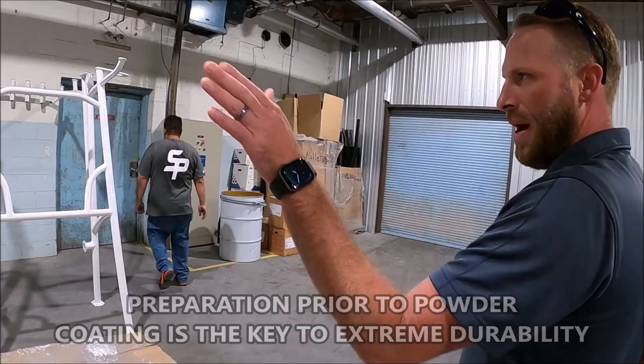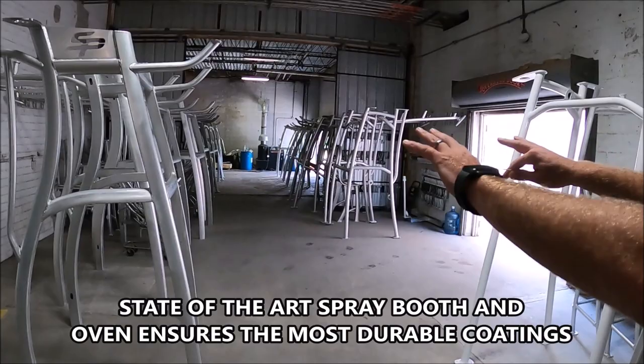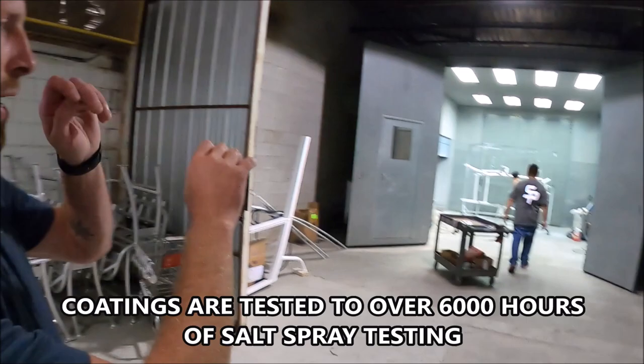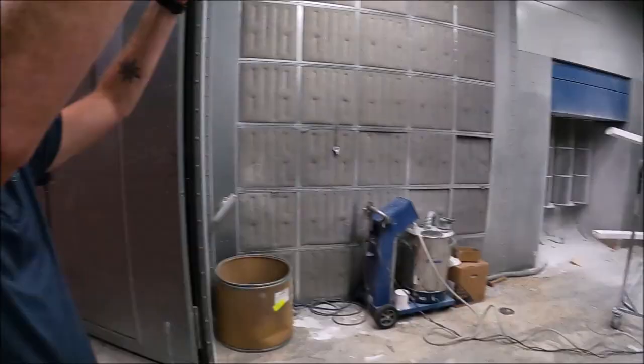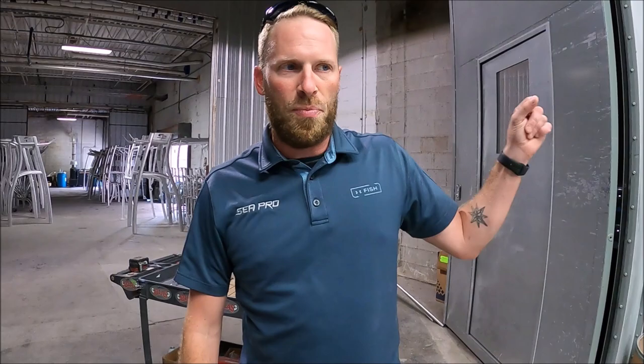We'll go through this door and we'll be in the middle of the process. When they come in the door, all these are ready to be powder coated — they'll get washed, prepped, come down this way, and get dried. We utilize this room for drying, and sometimes we have to preheat using an oven on the other side of the powder coat booth. This booth here is just to apply the powder. You can really feel the air — it's just enough not to disturb the paint but enough to keep it all separated. The thumping you hear is the filter cleaning itself back out.